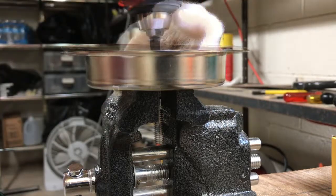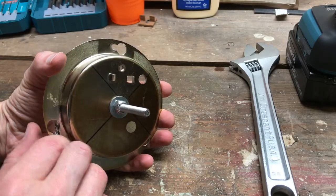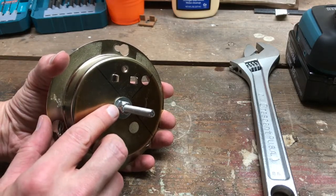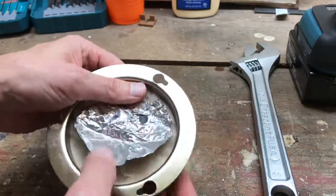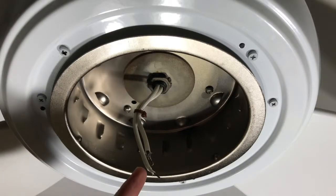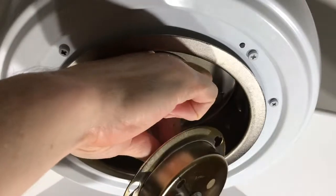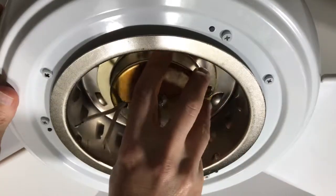Patience is important to avoid injury and damage to the parts. I checked twice that this nut is tightly fastened — it is holding everything in place, and I want to make sure it doesn't come loose when the ceiling fan runs and makes everything vibrate. Now I restore the heat shielding. I already used the wire stripper to remove enough of the outer and inner insulation so I can connect the LED module. Now it's time to reinstall the mounting plate. I carefully feed the wires through the hole in the heat shielding and the plate, then position the plate exactly over the three screws and rotate it back in place.